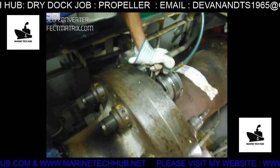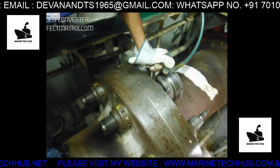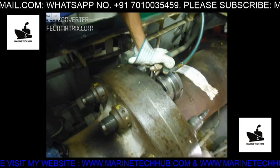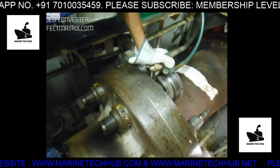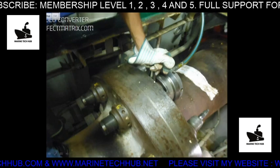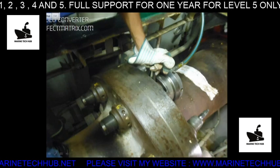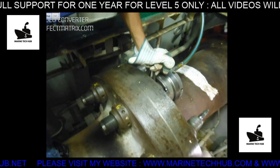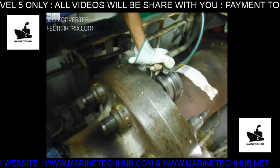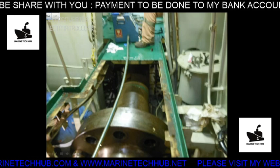You can see the hydraulic jack we have put, giving a pressure of 1000 bar. We are using an Allen key — or Allen bolts which will fit exactly in this — or a separate tool which will fit here so we can loosen it. This is one side of the hydraulic bolts; there is one more on the other side. We are removing them one by one using a special jack. You can see so many bolts have already been removed.